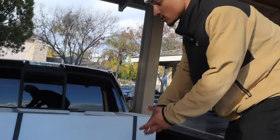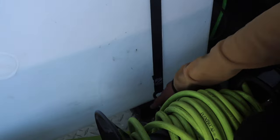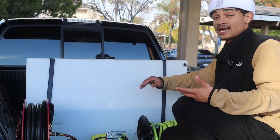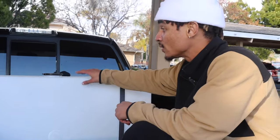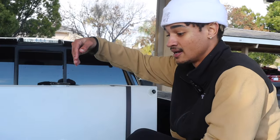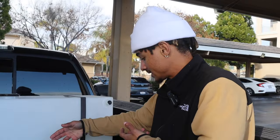Specifically how gravity fed works with my setup — you can see on the bottom we have two-by-four wooden planks on both sides that keep the water tank at a slightly higher level than the pressure washer. That helps with the flow and also so that we can use all of the water that's in the tank. An old setup I used to have meant the water would still be about this high but we couldn't get enough pressure to use the rest of that water. Now with this setup, even having no pump, because it's sitting higher on the two-by-fours it gives enough flow where the water is naturally gravity fed being pushed down so that it flows perfectly and we're able to get most of the water out of the tank.